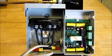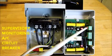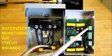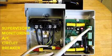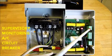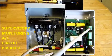Therefore, we've added a feature to the CW-3 called a supervisory point. The supervisory point reports back to the burglar alarm system that the breaker is tripped, and the monitoring company, if asked to do so, will alert the building owner or the homeowner that the power to their air conditioner has failed.